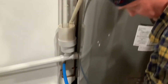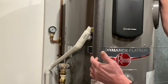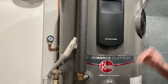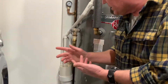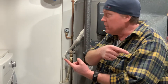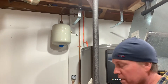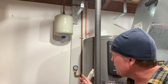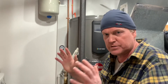You have your cold water coming in at the bottom and your hot water coming out of the top, and I plumbed the hot side with CPVC pipe as well. For hooking these things up I used a couple of different methods: compression fitting valves to tap into the line, regular copper and solder for most of the work, and SharkBite connections in a few places. The real advantage of SharkBite is you can do all your soldering and pipe work on a bench and then bring the pieces in and snap them together, which goes a lot smoother.